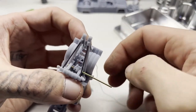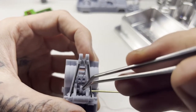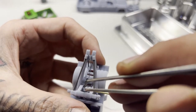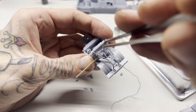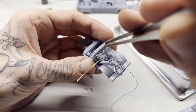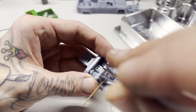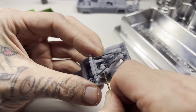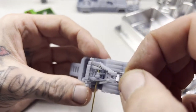Alright, we're through this part over here. Before you push it all the way, push your main lead line down under that — it's kind of a pain but it's worth it because it holds it in place. Sometimes you have to go back on the other side and push that down. You can see how it's under there now, holding it in place.